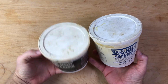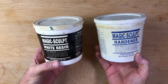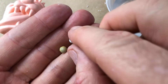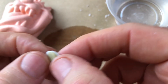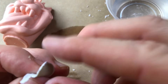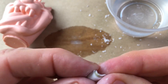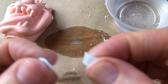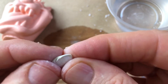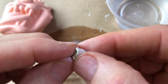One of my favorite materials in the shop is Magic Sculpt. I've used it for years for all kinds of jobs, and one of my favorite uses is patching or filling holes in castings. It's a two-part putty system — you mix it together and dispense exactly the amount you need. Since I'm filling tiny holes, I dispensed tiny amounts of each side. I just make little flakes of the epoxy putty and knead it together like this.